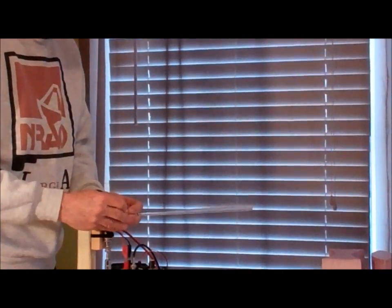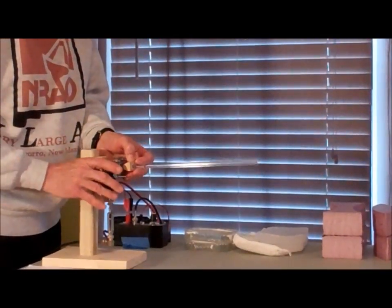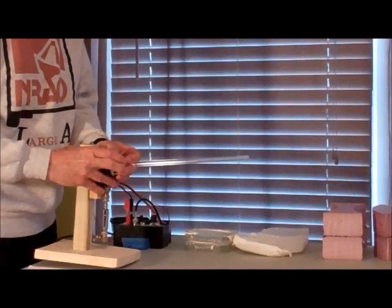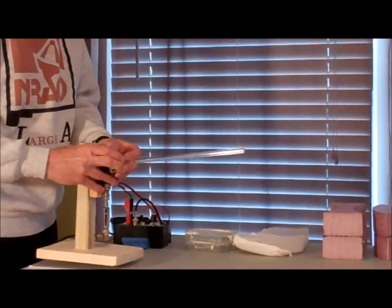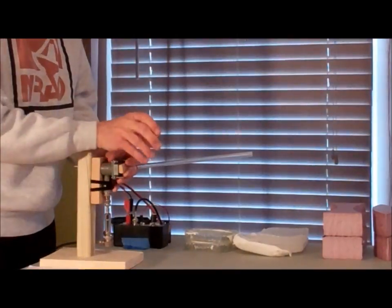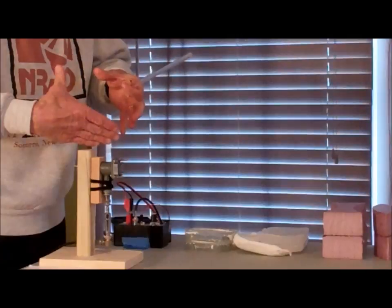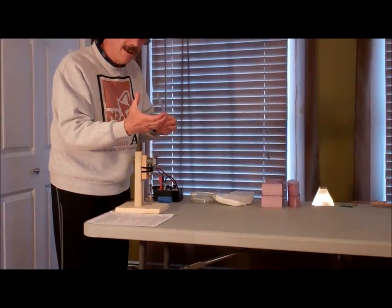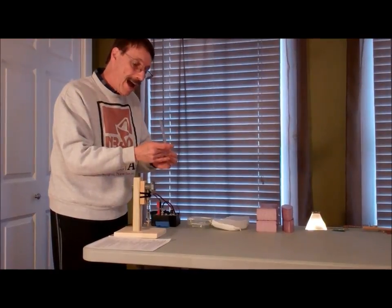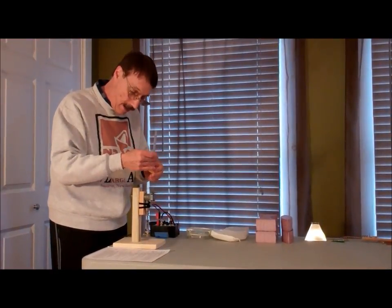It peaks the meter. Okay? So what is this doing? It's behaving like a lens, but the other thing I want to show you is, we talked about beam width, very narrow beam width, and the strength is like a very large horn. So this thing is behaving as if it were this big. So it's a very interesting refractor and perhaps a waveguide, lossy waveguide.